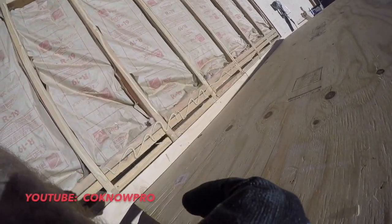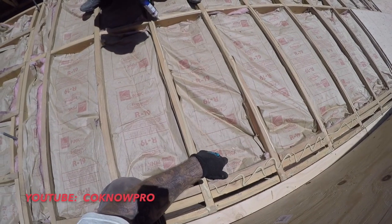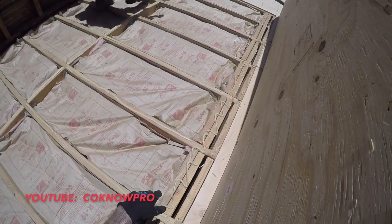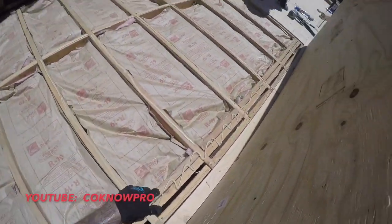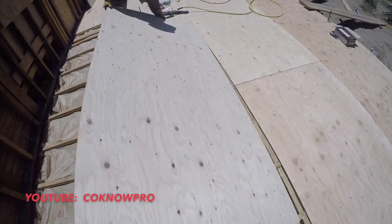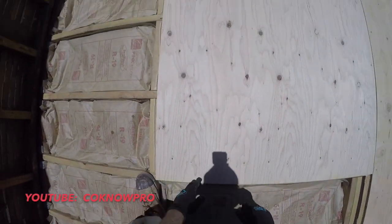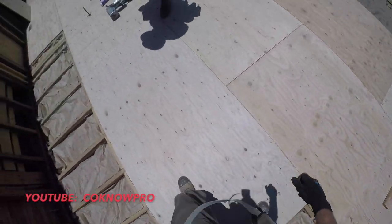And if you do have to take off, it's a good idea to wipe off any excess subfloor caulking. If it's not underneath the plywood, you're not gonna end up getting more plywood on top of it before it dries. All right, let's drop it. Bring it in, set your corner in there. Nice, okay, let's drop it down. All right, we're looking pretty good. Nice, I like that.